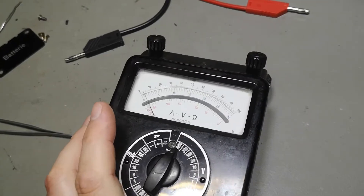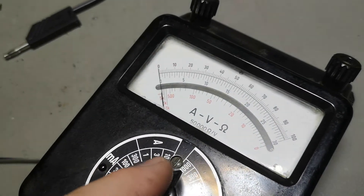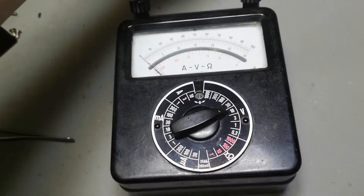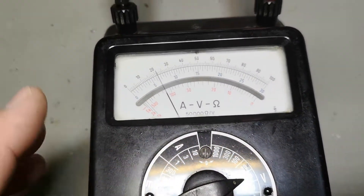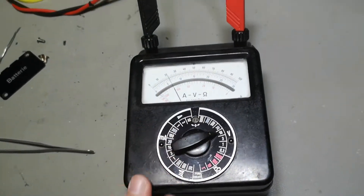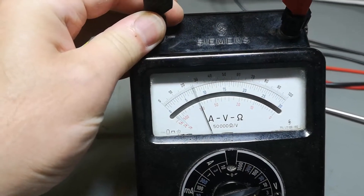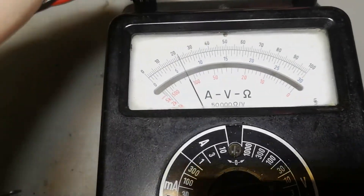That was really good - I think I fixed it, look at that! It also responds to this. Let's try and put it in 10 volts. This is two volts, okay, so it shows a little bit too much, but that is very very little - it should be fairly easy to adjust. I'll put this back together and call it done. I'm happy about this fix. And look what happens when you put it upright - this is a classic problem with those mechanical meters, you're of course supposed to read them lying flat.